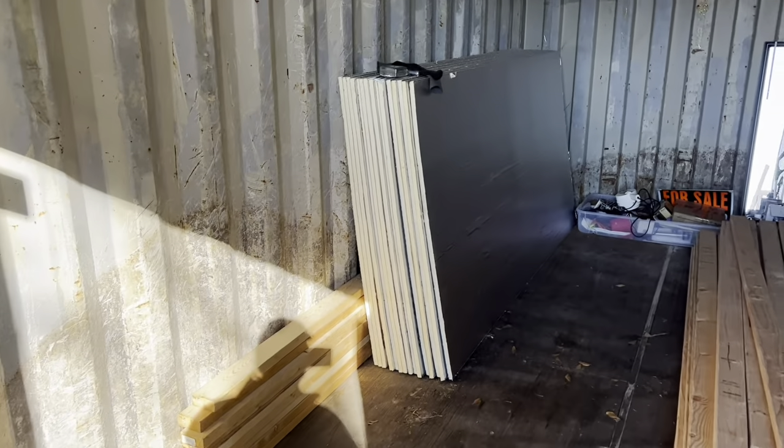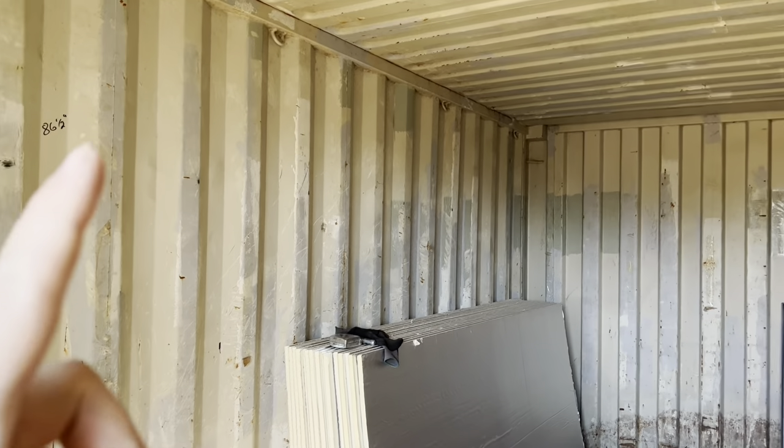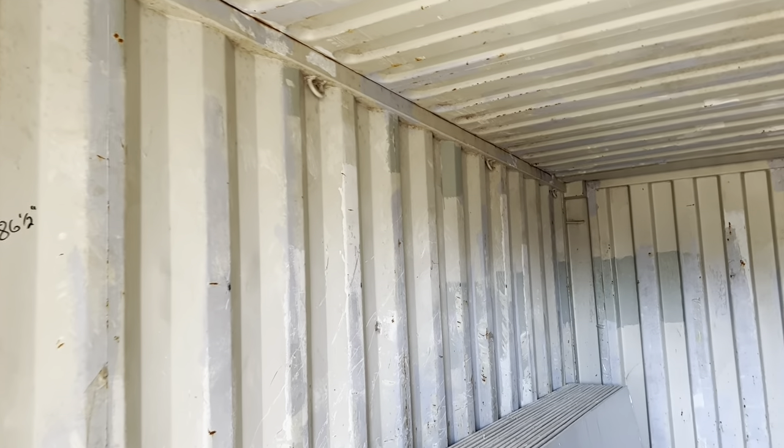This is the inside of the shipping container and they start filling up fast with junk. I was going to go two-foot centers on the walls and 16-inch centers on the ceiling, but I think I'm going to reverse that — 16-inch on the walls and two-foot on the ceiling. I'm going to leave a little room at the top where the two-by-four just slides in and I can add as I need to. Everything I'm doing is temporary, because once our house gets finished this container is going to turn into something else.